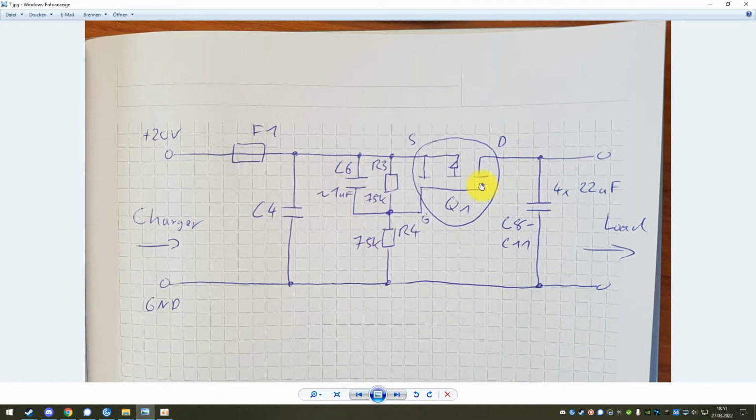But this, however, does not yet explain why there is damage to the board, because when one of these guys is just shorted, let's say this guy was shorted, then all that would happen is that the charger would detect that there is a short on the output and would shut off right away, and you would still have the short and your product would still be dead, but you wouldn't have any visible damage at all, at least. What happens now is, because here is a short circuit, each time the charger is plugged in, first this inrush current limiter tries to turn on and passes current in a certain way until it's just too much current and the charger detects the overcurrent and shuts off again.